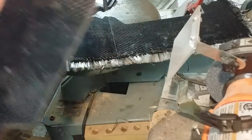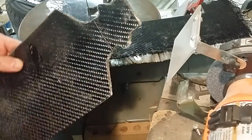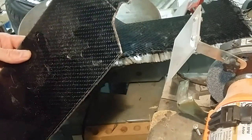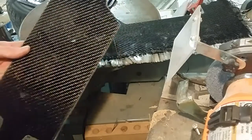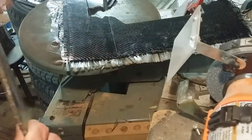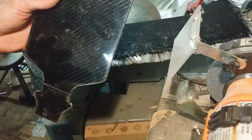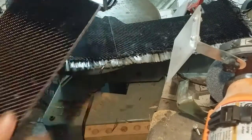Typical saw cutting rules apply here. You always want to cut on the outside of your scribe line. You can always file it down or sand it down later, but if you cut it too narrow it's really hard to put extra carbon fiber back on. So there's the basis for our carbon plate — now we're going to clean it up and start drilling some holes.